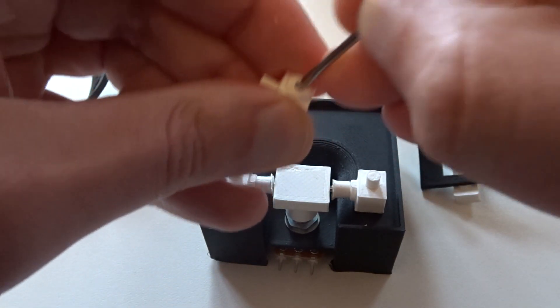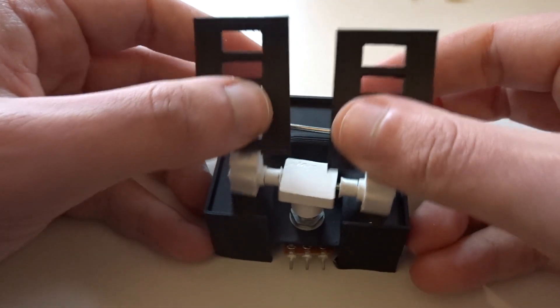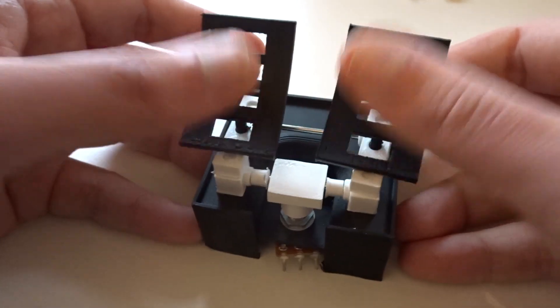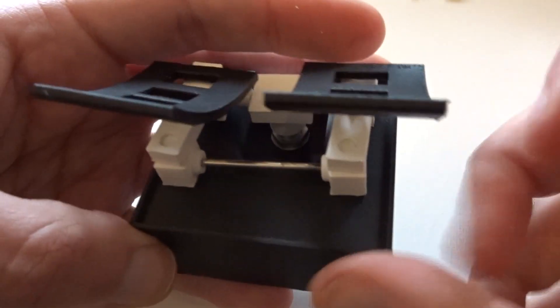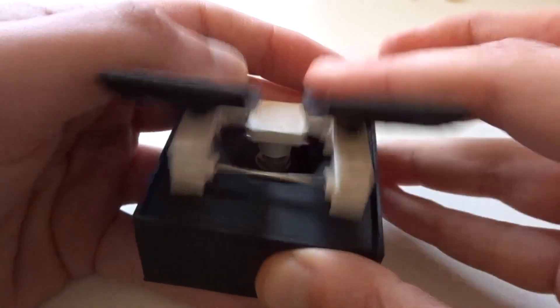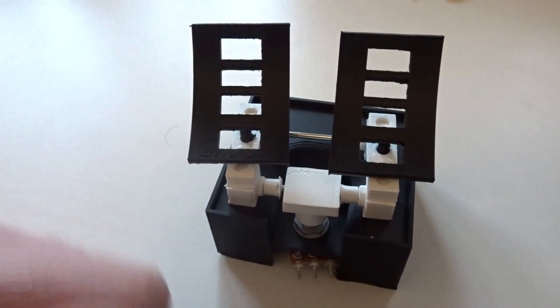What makes this work is that the pedals can move freely on the crossbars — that's why the bar is round. It can turn and twist. Because we don't tighten the pedals to the crossbars, there is a free range of rotary motion, so when we push a pedal forward the crossbar can twist in place, making the potentiometer turn.